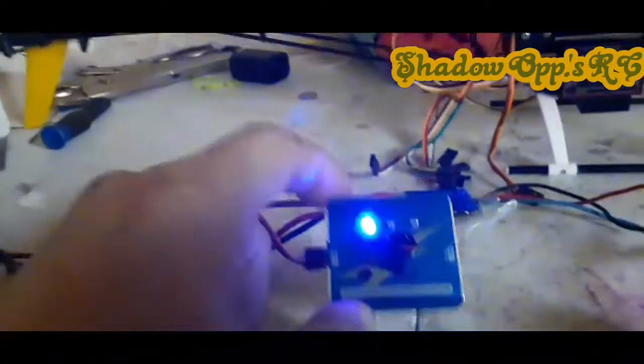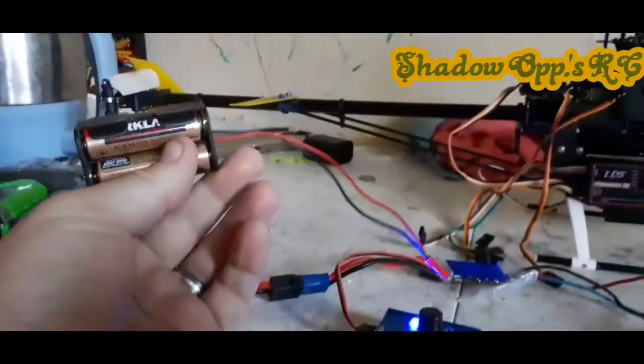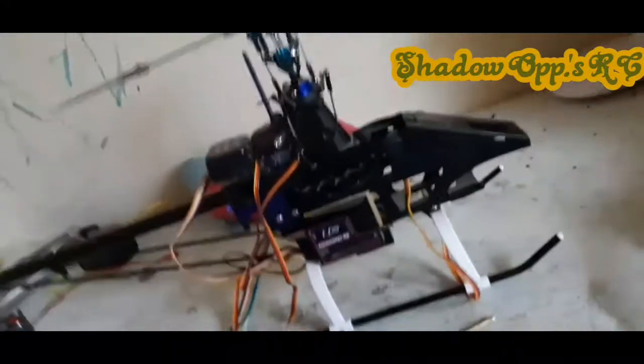With this tester, you can use an auxiliary power source. I just use this power pack out of all my nitro cars — with four double-A's, it's enough to run servos. But when you run a motor, it's not enough. So if you use the lead from the ESC, it will prevent too much power from going in here to blow this, because it's got an internal BEC that won't allow it — it only gives you a couple of volts, which is all this tester is rated for.